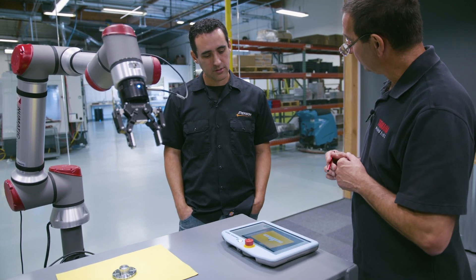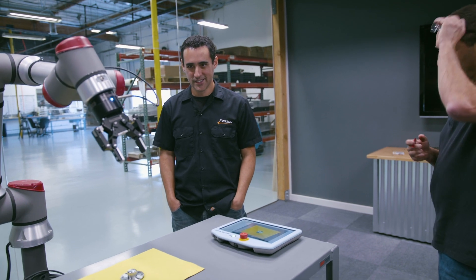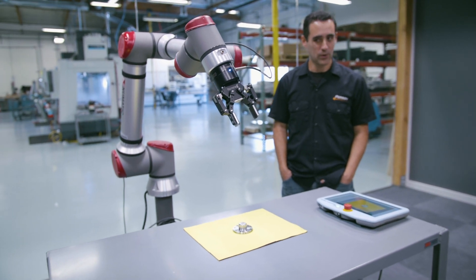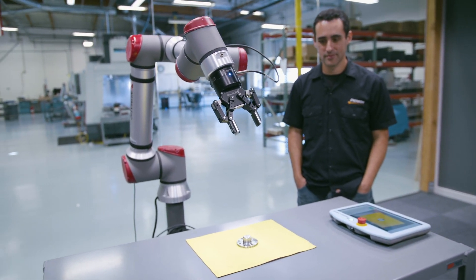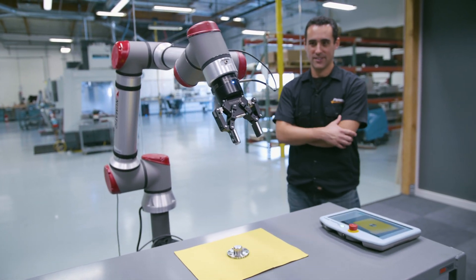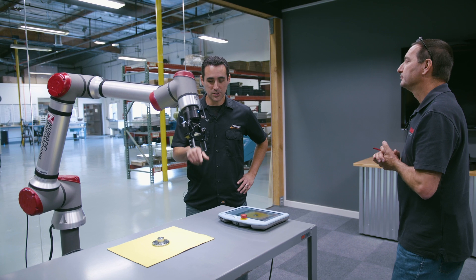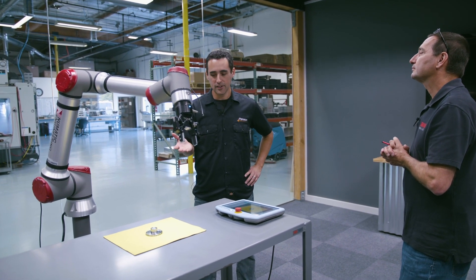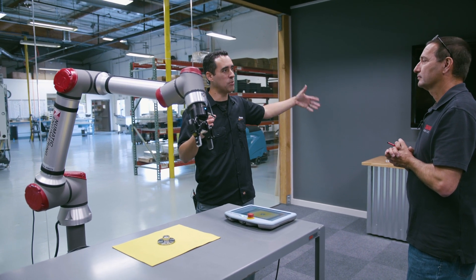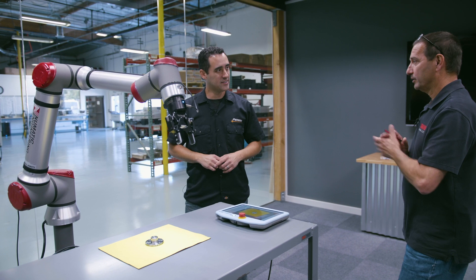Now it's going to say 'robot will move automatically.' This is the beauty of it — you just say, okay robot, I taught you the part, knock yourself out. I want you to take a picture. Hands-free, the robot is taking images from all different angles so it can find the part every single time. It's going to take nine of them. And this only has to happen once — for every part you do, you just do it once and that's it. So because we make a thousand of these per run, we only need to set it up once, and when we start the next batch of another thousand, we save all the camera data. That information is retained in the robot and the camera.